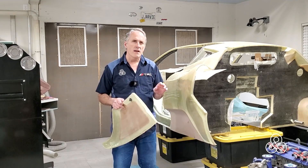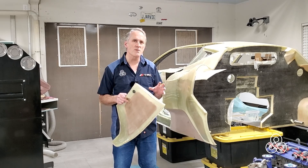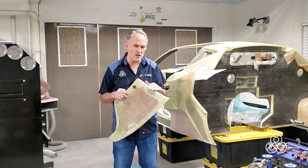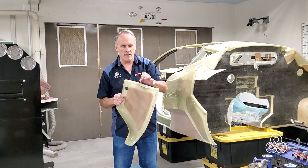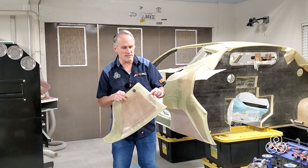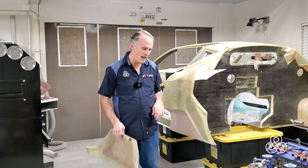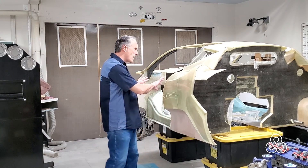Now if you've watched videos in the past, we took molds off of the plug using a system where we put flanges on the plug and then used flashing on those flanges to turn back in the opposite direction, creating a little step in our parts. So instead of just a flat panel we have at least a step back. But there are some places on the car that are going to be much more complex than just a single turn-back — one of those of course is the door seals.